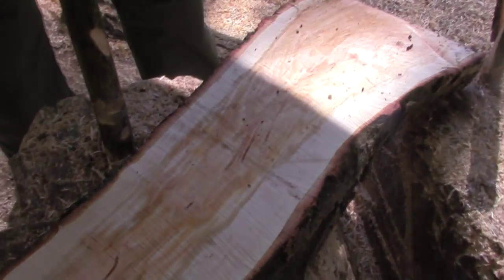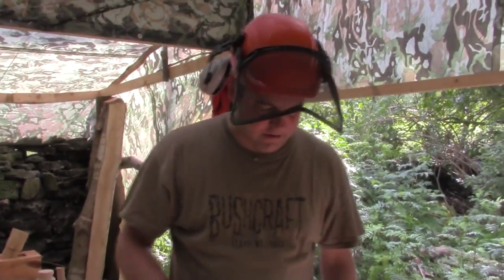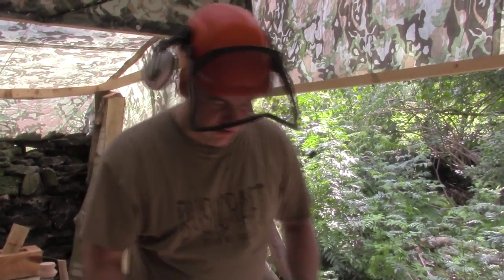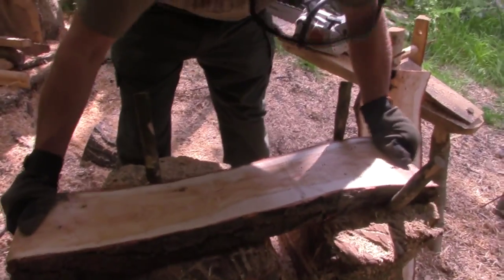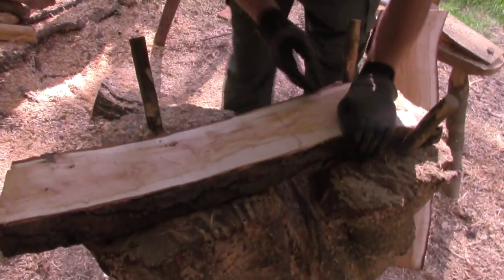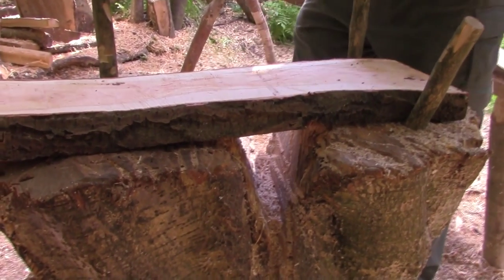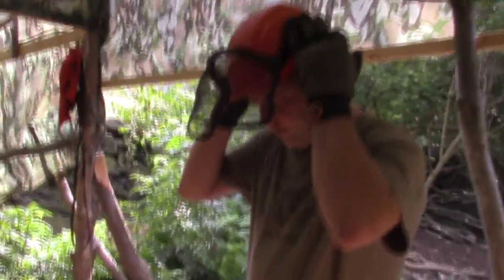It gives me guidance. Now, this is what I like about doing bushcraft furniture and things, you can sort of make it in your mind. I've seen various people make these chairs, actually cut the slot in at a certain angle. I'm going to stick to a simple 90 degrees because I think that's easy, no problem, and I know I can probably do that with a chainsaw. So I'm going to go for a 90 degree cut. I'm going to position it over my hole here so that I can get my saw in. Again, I'm going to keep to the side so that there's no risk of the blade hitting me in my leg. Even though you're wearing chainsaw protection, you don't want to do that. So I'm going to get cutting into there using my little Stihl.